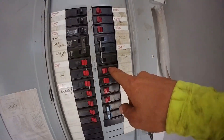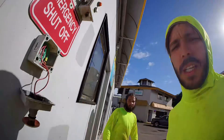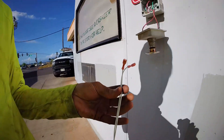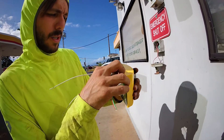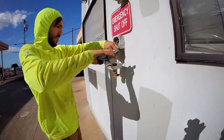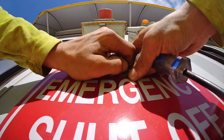Okay, e-stop control — we have that up, guaranteed that's it. Yeah, okay — this is off. I'm just going to get to work on it. Why mess with the controls? Just shut it down and make it right. This kit comes with these little jumpers — they basically have these little spade terminals and they plug into here. You can see from the side it says normally closed, normally open. I'm going to plug in common here — normally closed. We're going to take this apart. The fastest way to do it is just cut it — it's normally closed so I don't need to worry about which one's which.